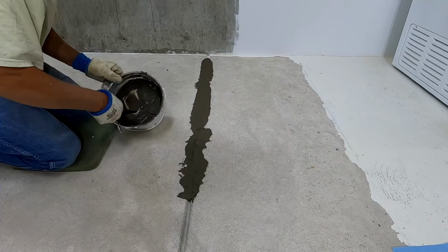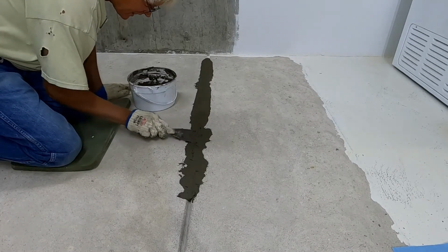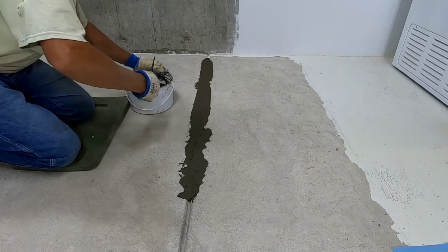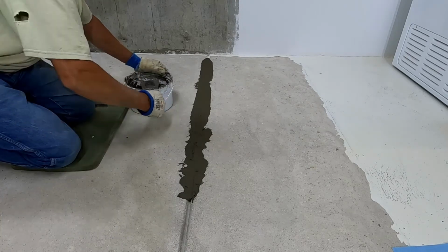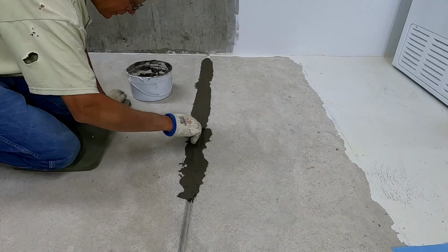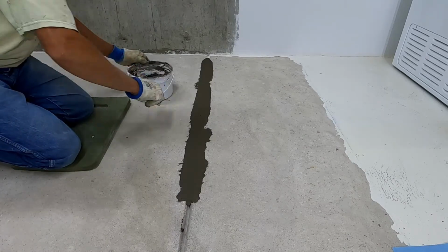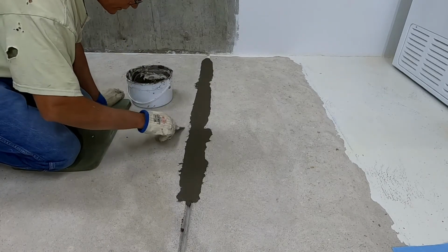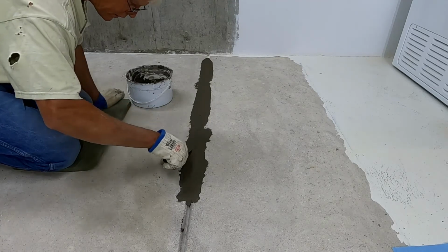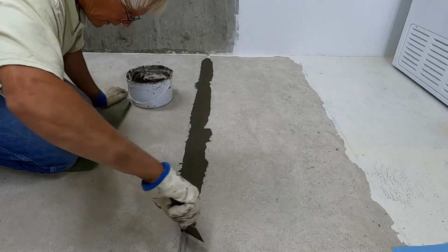So making sure that I have kind of a ridge of compound. And then I start off a little bit tall. I'm going to start my wipe. Low angle to the knife, modest pressure. The key, I think, is trying not to overwork the compound. Now what I'm going to do is scrape off the ridge here, putting a little more pressure on the concrete side, the non-blunt side, so just scrape it off.